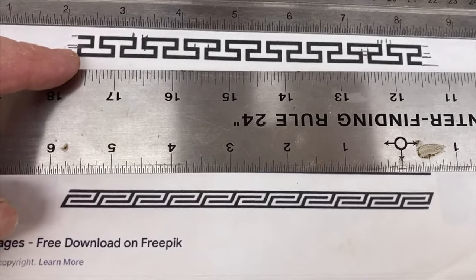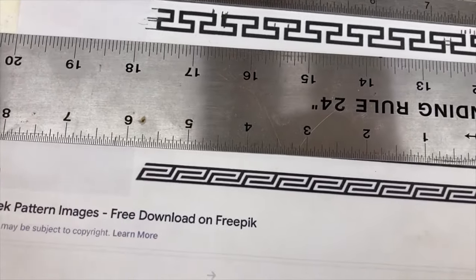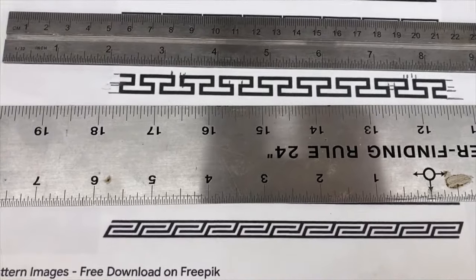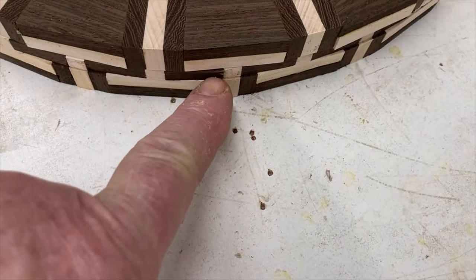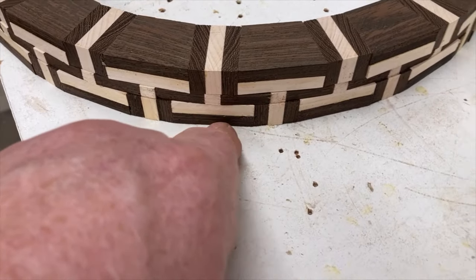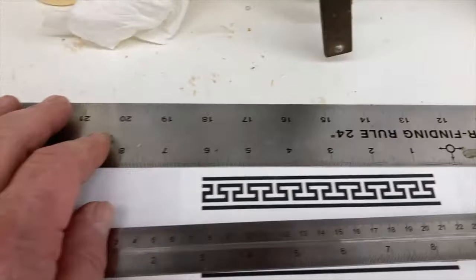And then the last challenge was to make this center part right through here as a ring with quarter inch wide maple stock and a quarter inch thick by, I can't remember what the measurement was now, but I actually made it 72 segments. 72 segments is the center ring right there. And these others end up being 36, because this is a laminated piece and these are laminated pieces. So when it's said and done, I have other rings that I'll put on it. It will make it bordered like that. Anyway.